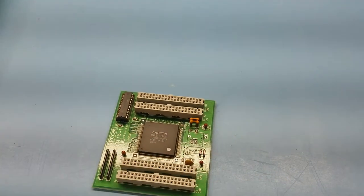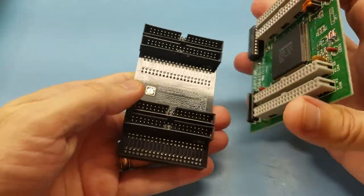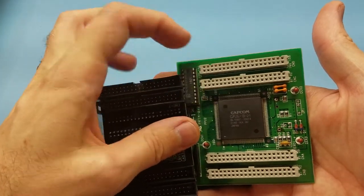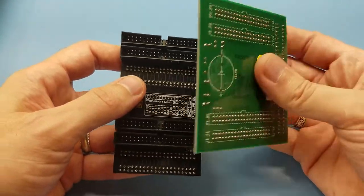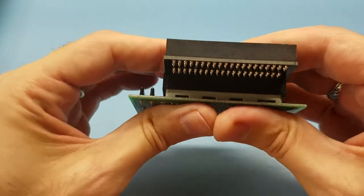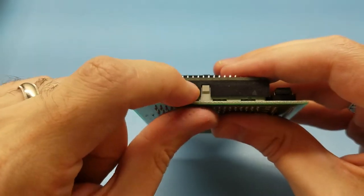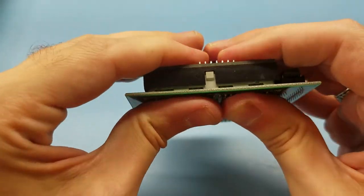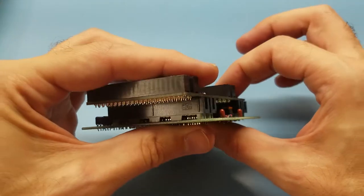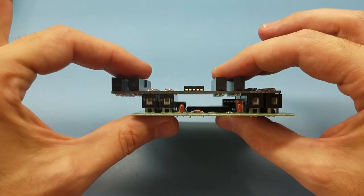So let me change my camera position, and then we will mate the Infinikey with the C board. As you can see, there are keys on these male connectors and on these original female connectors. So that takes some of the guesswork out of whether you've got it oriented correctly or not. I'm applying firm controlled pressure to both ends, and you can tell it's seated when that key gets close to the black there. You can see that they are relatively parallel, which is a good indicator that we're all the way down with the key all the way up in parallel orientation.